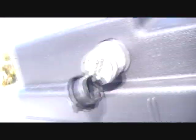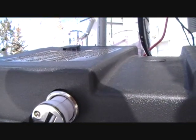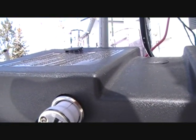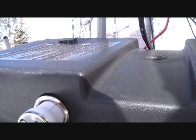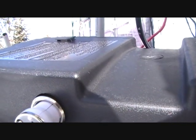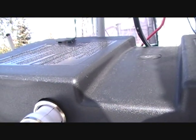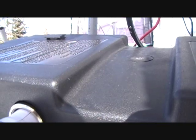If you want to plug in your AC, that goes directly to the battery. I also have a cool thing I picked up for five bucks — if you can see the green or blue light, it does a USB port, which is good for iPads, iPod touches, and cell phones. It takes anything from 24 volts and puts it down to five volts at a thousand milliamps.